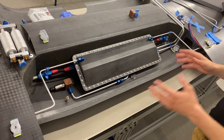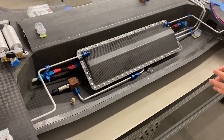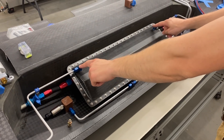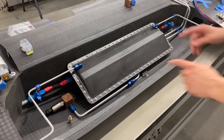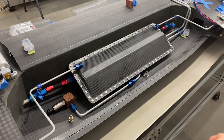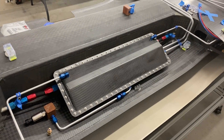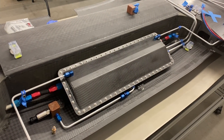Just high level what we're looking at here: we've got our sump right in the middle that we've shown in previous videos. Our left tank feeds in from this line right here and then our right tank feeds in from this line right here. Up on top we have our fuel vent lines that I've constructed and installed, and those feed both to the left wing and the right wing and then back into the tanks. On this side we have our supply line that comes up above the wing and out to the engine, and we also have our return line that runs parallel to it.